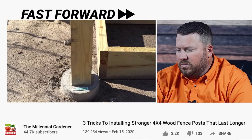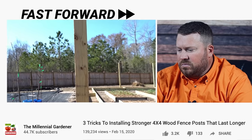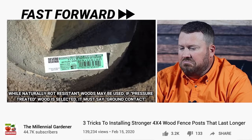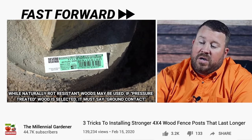Now this video itself is about 11 minutes, so I'm probably going to skip forward on part of this. All of the wood posts that you see in front of you are four inch by four inch by ten foot long posts and they are all number two pressure treated lumber that is rated for ground contact. Any wood post that you set in earth absolutely has to be pressure treated and rated for ground contact.